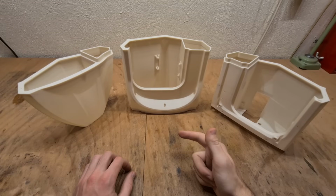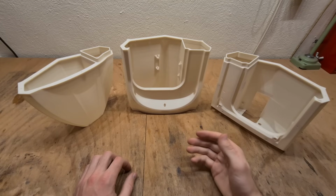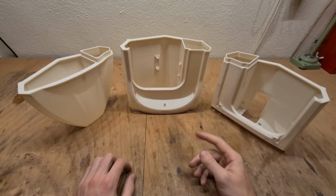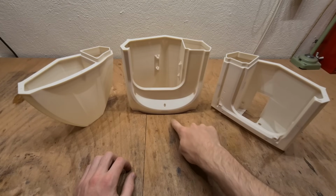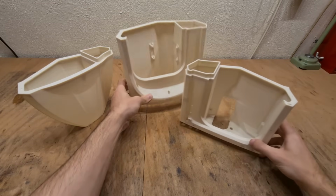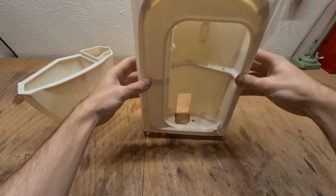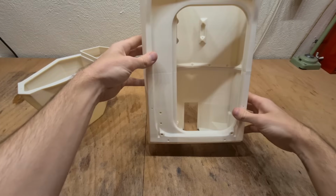So the second purpose of choosing this printing orientation is to fight warping. Even if you have perfect print settings, with some materials it might just happen that the prints warp. And what happens is that only the surfaces which are lying on the build plate might deform. The top surfaces are straight. So the advantage of printing like this is that when you start the assembly, you glue the hull middle like this, and both of these surfaces are flat. So this joint is okay.